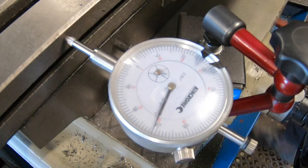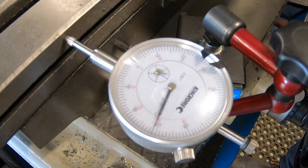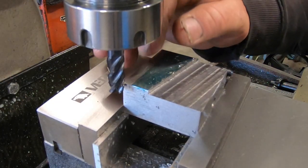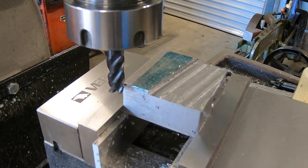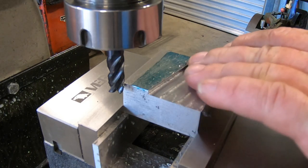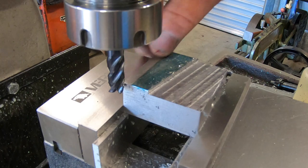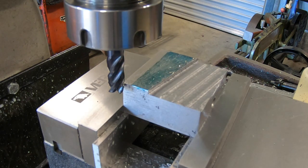Oh shit, better take in the diameter of the tool. That was a mistake, better do some more measuring. Okay, I fixed my mistakes. Yeah, I think I'm pretty much spot on. So I had to come in 392 as well for the diameter of the 10 mil tool. So I am right now to just keep milling this triangle out here and pretty home and hose.